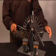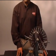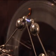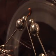On a low humidity day, a 10 to 12 centimeter spark can be generated at around 70,000 volts and 50 microamps. Place the electrodes 1 centimeter apart and turn the handle. The spark will be very quick. Place an index card between the two electrodes. Small dimples will form as the discharge goes through the card.